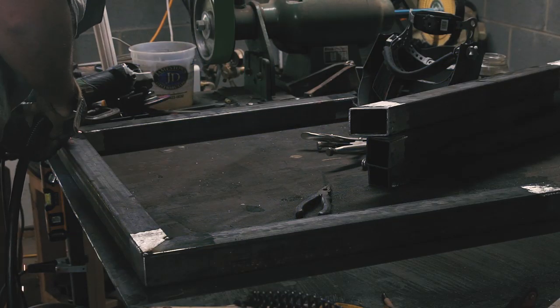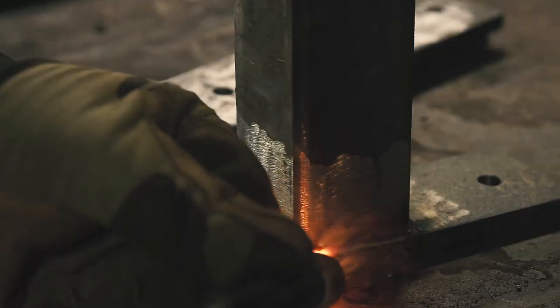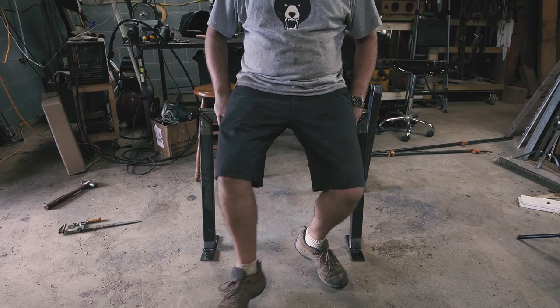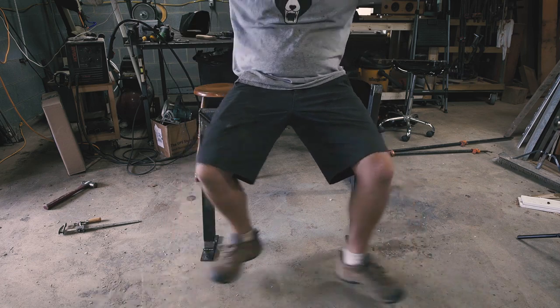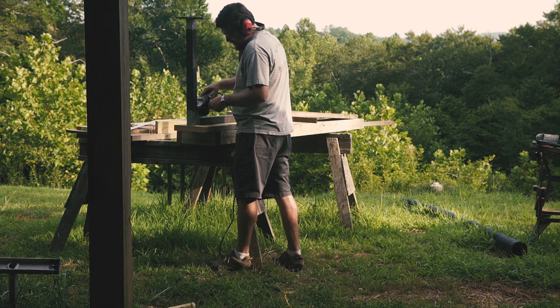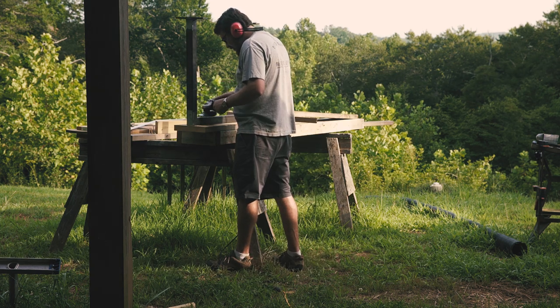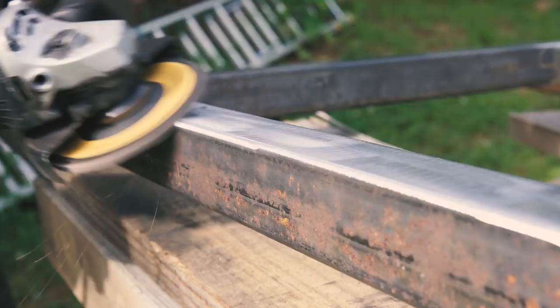I was concerned about the racking factor without the stretcher, so I cut some 1/4 by 2.5 inch steel about 8 inches long to make some really stout mounting plates. My 4-month-old son was napping right above the metal side of my shop upstairs, so I took the legs outside to grind the welds flush and give the legs a flap disc treatment.